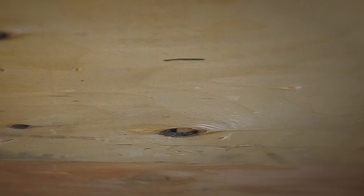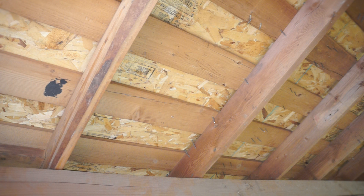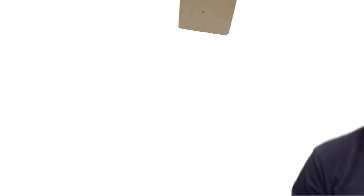If you're able to drill a hole into the roof prior to installing the wood block, a 2x4 or 2x6 wood block will work well. From inside the attic you can clearly and carefully position that wood block so that it's centered right under the hole you've just drilled through the roof. If you're not able to drill holes in the roof before inserting the wood block, it might be desirable to use a 4x4 wood block — that way you'll have a bigger target area to hit when trying to find that wood block from on top of the roof.